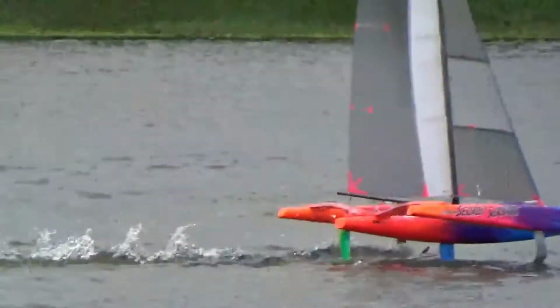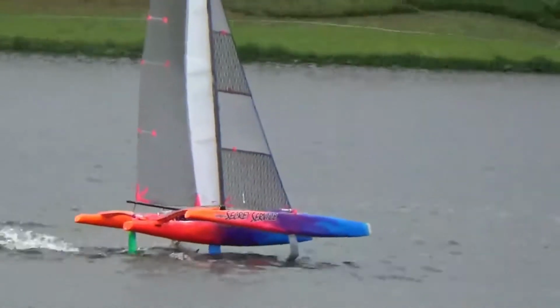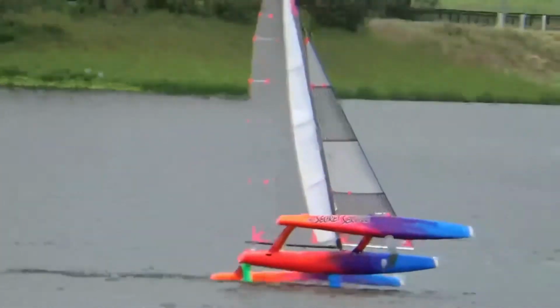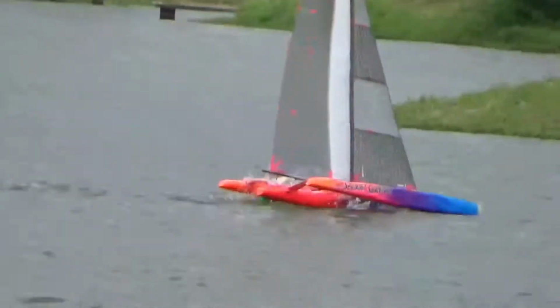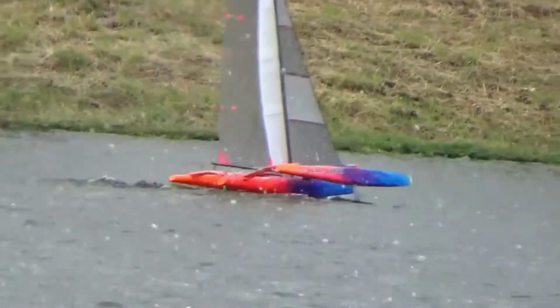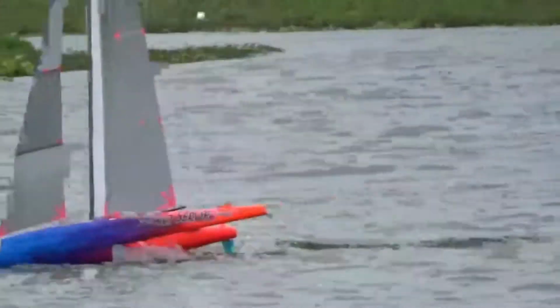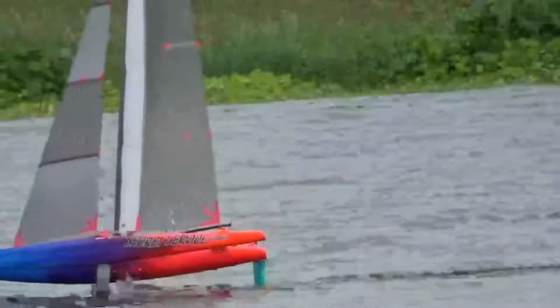These U-foils have been modified since the past outing 2 weeks ago, and the outboard section of the foil is now 5 degrees more vertical, reducing its lift when the boat is flat, whilst the inner part of the foil is correspondingly 5 degrees flatter. The idea behind this design is that if the boat heels, the lift area actually reduces as the inner section of the foil becomes closer to vertical.